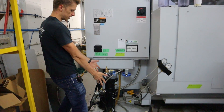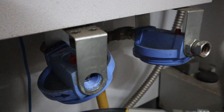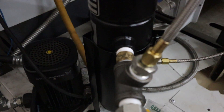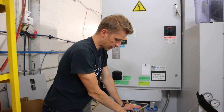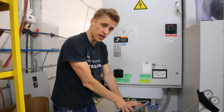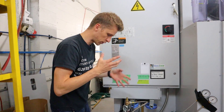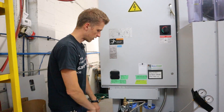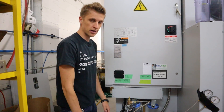Next up we're going to install the filter on the mills. The old canisters were mounted to these blue things and we had some plumbing and fittings, but we ended up getting the same filter we have on our Nakamura lathe — also from McMaster. The blue ones are about fifty dollars per canister; this one was five hundred and thirty US, so it's a lot more, and with all the fittings the total came to about nine hundred US. We added a pressure relief valve here just in case it gets so backed up you don't want to create a pressure canister that could explode.